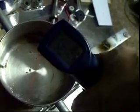To reiterate: it's been 10 minutes, the potassium nitrate solidified already and the temperature is still around 260-270 degrees — it really retains heat. So far, without changing the tip or liters per minute, we can solder for plumbing, braze for refrigeration, cook food or heat water, heat a space, and melt metal as seen in other videos. We'll see what else we can add to this list in the next few videos.